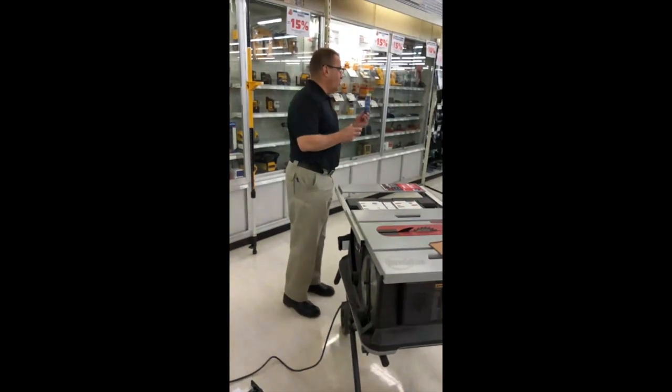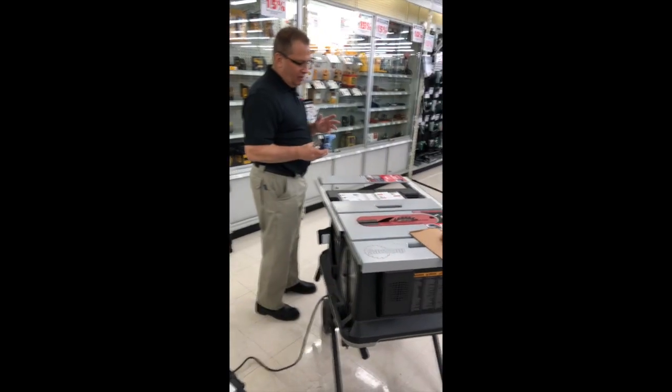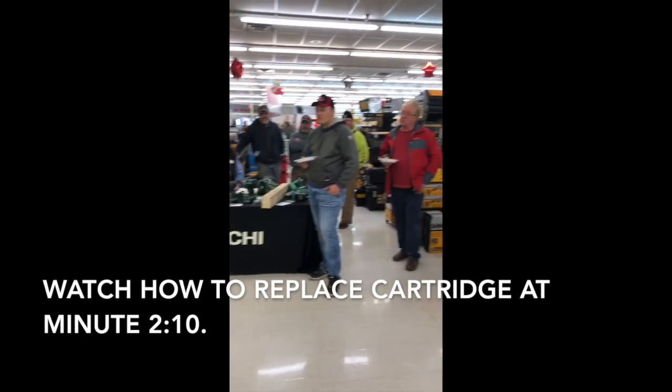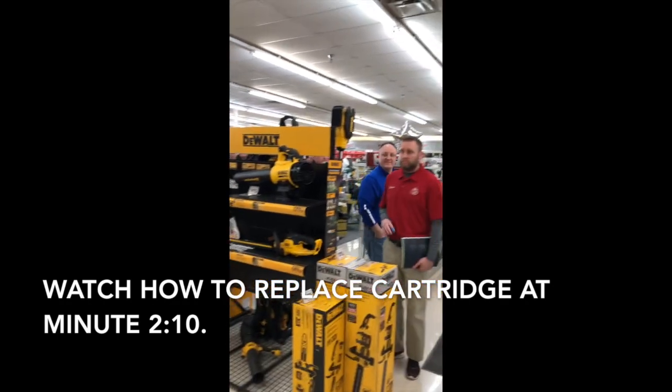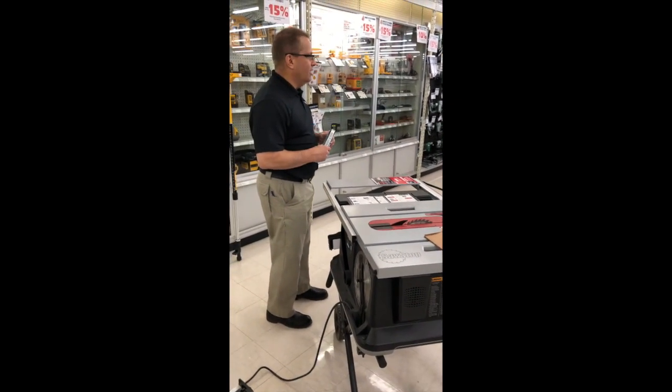Every single time you shove your hand in the saw, you gotta buy a new brake for $69. What's involved? Blades can often be reused, but we suggest never to reuse a blade without extracting it from the brake and sending it to a sharpener. The blade's worth sharpening and investing in a few new teeth, and it's worth it. If it's not, you just chuck it and it's garbage. So anywhere from $69 to $150 is kind of your skin in the game to avoid it.